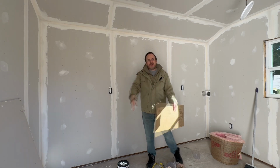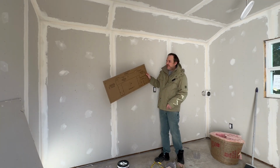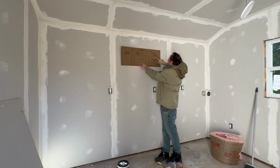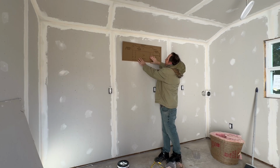Think of it like a step ahead with the actual next step. So you've got a nice template here. The wall bracket basically goes on the studs. The studs are here, 8 inches off the top, and you need a gap of at least 15 inches each side. No problem at all here. Obviously, you've got way more than 15 inches. So 8 inches, I'll measure it. It's going to be about there-ish.